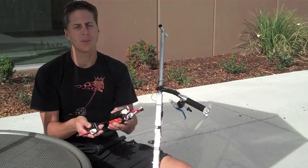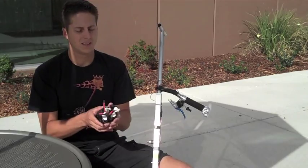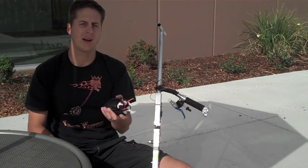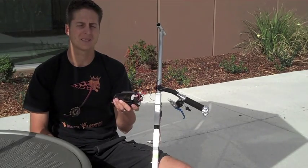I'm using four lithium polymer batteries on this prototype. I actually got these from my RC helicopters that I fly. The way I put these battery packs together it equals about 24 volts and about 5,000 milliamp hours of juice, and in total they still only weigh about 550 to 600 grams.